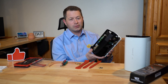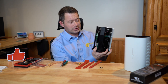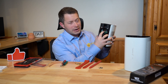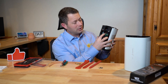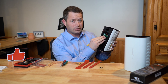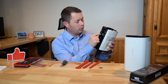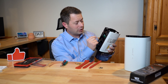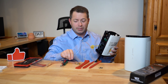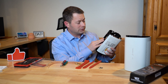I obviously already have this one apart. Just to show you inside — this is actually the front, and on the right side it has very easy access to the U.FL connectors. This model is from Sagemcom, which also makes some T-Mobile ones, and the T-Mobile 5688W has a very similar setup, so I was able to mimic that. There are four ports there — each one will be popped off and you can hook up your extra antenna fairly easily.